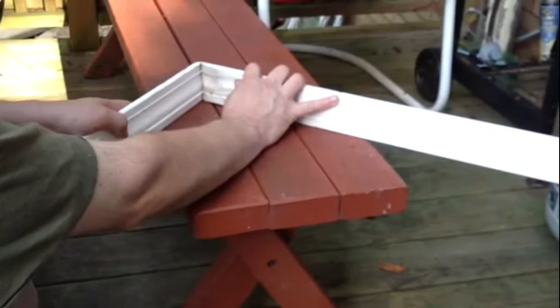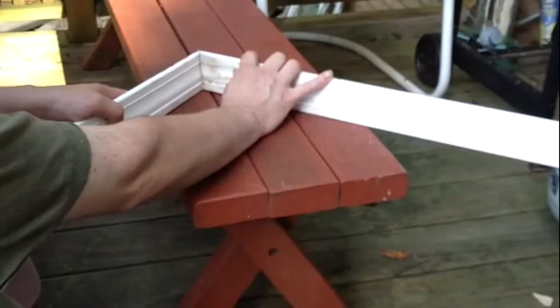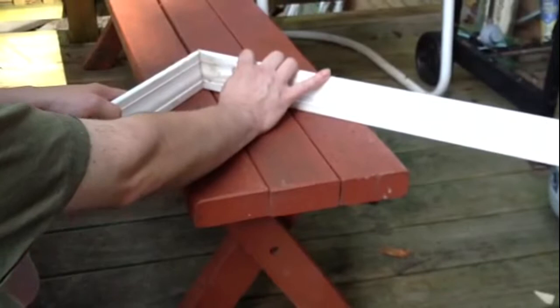You can also cut two 45 degree angles, but rarely is a wall exactly 90 degrees — usually it's in or out. If you're painting your woodwork, you can cut that joint and just paint it.